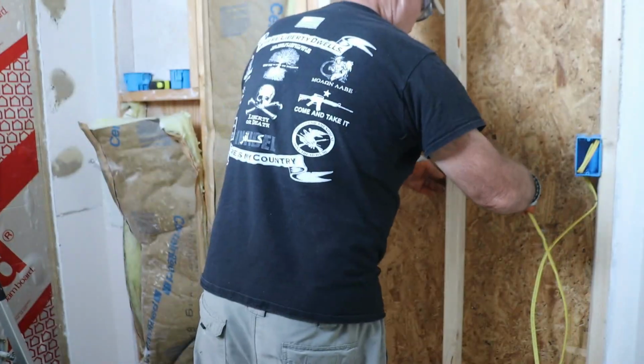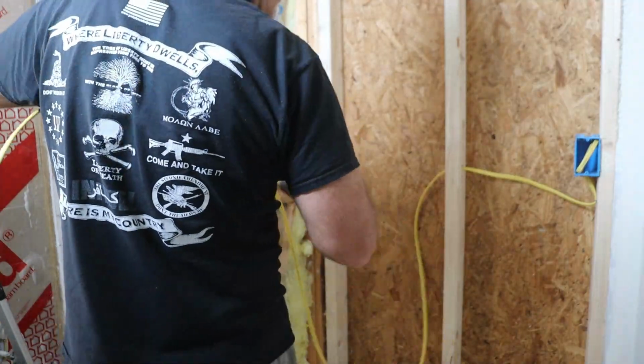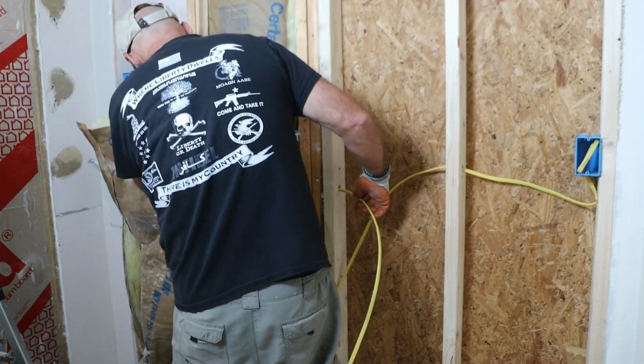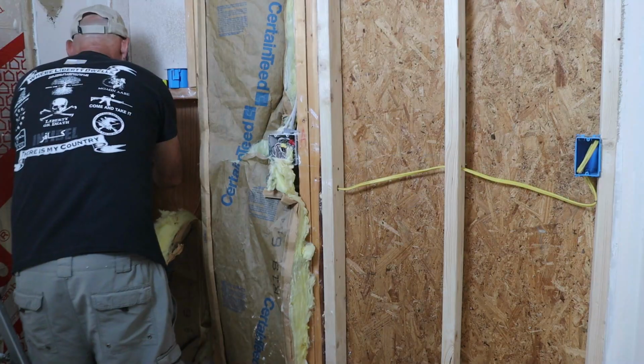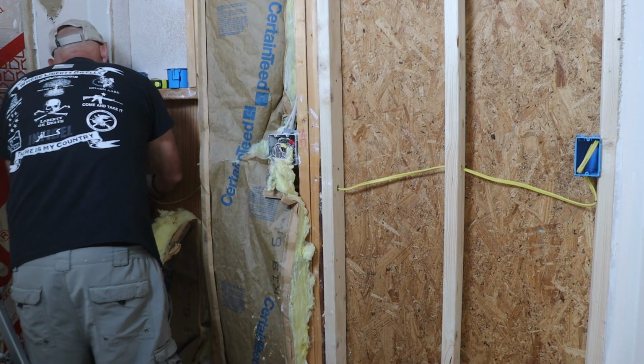From there, I pulled the wire toward the existing GFCI box. To make a clean run, I drilled 3/4 inch holes through the studs using a spade bit, creating a simple raceway for the conductor. Of course, before doing any electrical work, I shut off the power to the bathroom circuit at the main panel. Always better to double check that one.